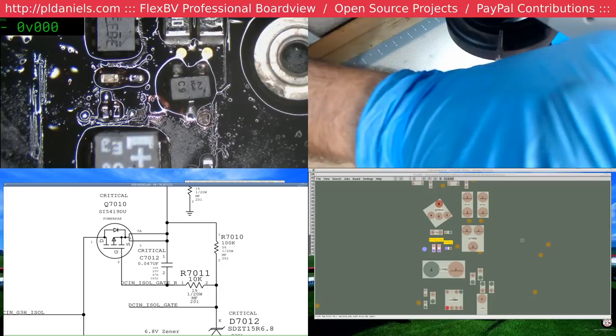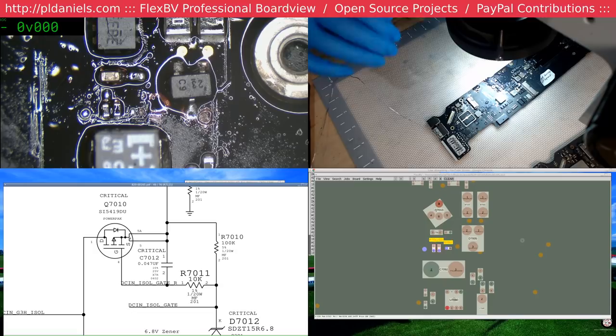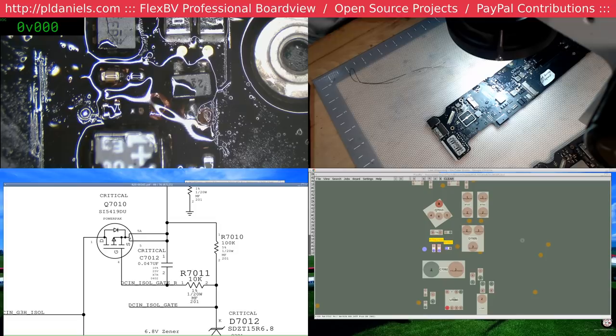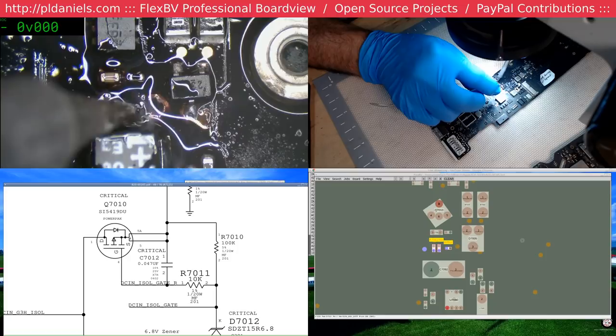Yep. Oh well, is that charged? It took the bottom right off that diode. Neat. So that diode essentially will result in a permanent bleed current always going through it. But it's coming through a 100k resistor, and so you're dropping 10 volts over 100k. It's pretty much insignificant.